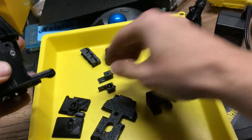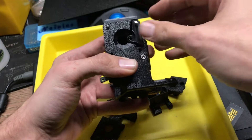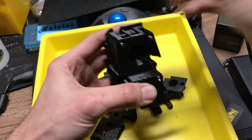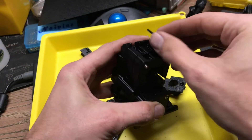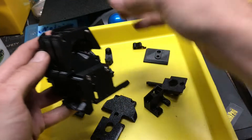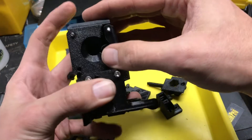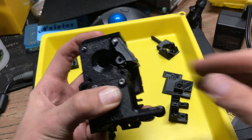As it sits, this is basically the standard MK3S idler. You've got the idler door here which, under spring tension, maintains the second half of the Bondtech gear in constant contact with the center gear. Your filament sensor goes here, triggered by the flag — you can see my other video for how that works. The ball goes in there. So that's standard, and then you've got your little hat there for the top. That completes the MK3S extruder build as a mock-up.